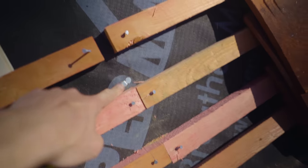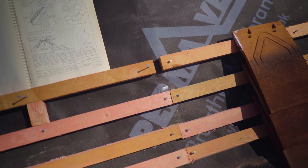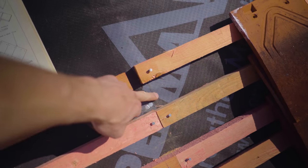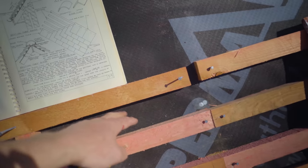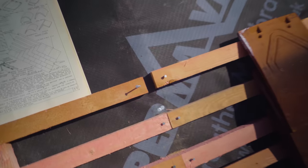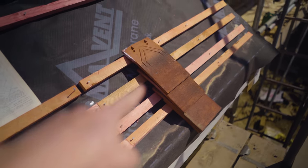About removing all these battens and the nail holes — what I've done is put a couple of clouts over the ones that are poking out so nothing comes through. The holes are going to be on top of the rafters anyway, and because I've got a bit of a sag in the felt, all the water should run down the middle and not go near the holes. Just to be safe I put a couple of clouts in. Now that I've finally got the spacing sorted, let's start cracking on.